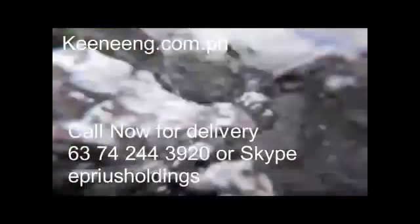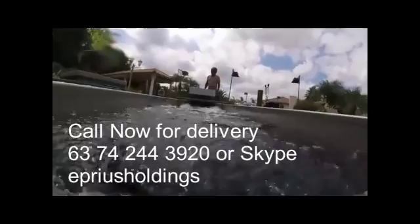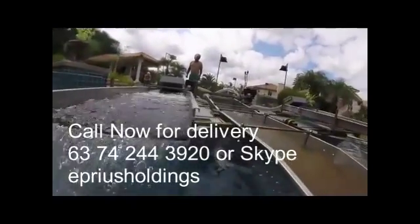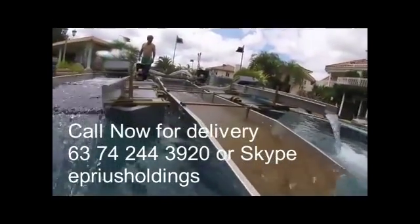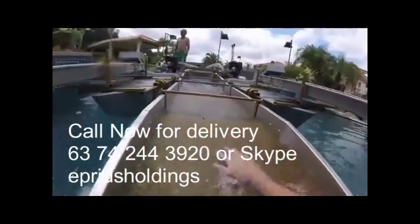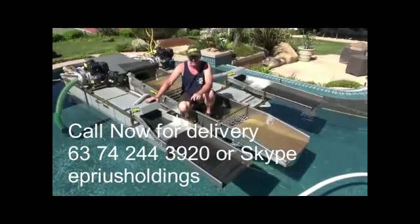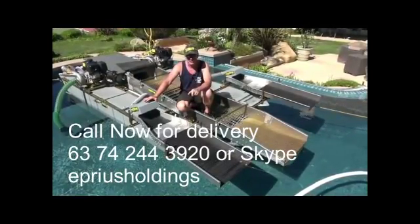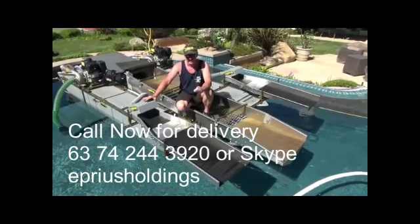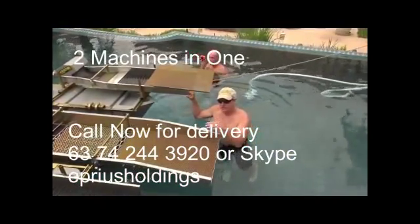Because let's face it, in a gold recovery system, the sluice box is going to catch all the visible gold. We're going to catch probably everything down to close to 100 mesh, and you'll lose some of the finer stuff. But with this system, all the sand goes into the side box, and I don't care if it's a 200-300 mesh particle of gold, it's going to get stuck in this riffle. It works that good because I've already got the optimum recovery system right here, so you might as well take advantage of it.